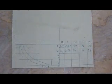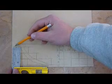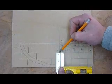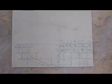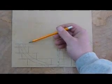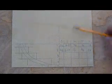Then using my combination square, I will come in and mark a line across. Okay, go back, drop it down, in this case 3/4 of an inch, come back and mark a line, and I do that to all the layers. Then going back to the combination square again, I start establishing the width that each segment needs to be. Now, this bowl is going to wind up being a 12-sided piece.